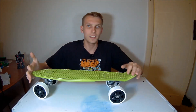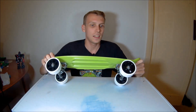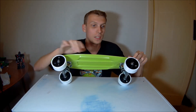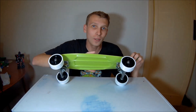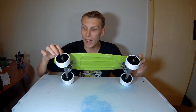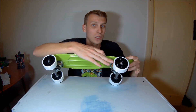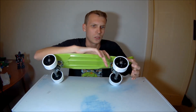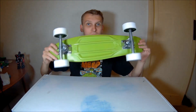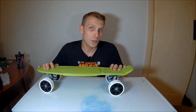It is done, and it's also a few days later. I've had a haircut and changed shirt and everything, and the reason for that is these rubber wheels — which were basically the whole point of doing this — took so long to actually get printed. Each one of these rubber wheels takes 12 hours to print because I have a stock 3D printer, so I have to run my rubber filament really really slowly. These aren't actually a complete full infill either; they're only about 10 or 20% infill, which is not great considering they're about to attempt to carry my entire weight. These things took 12 hours each to print and there are four of them.